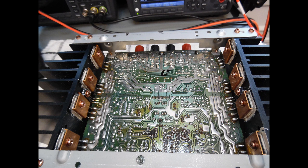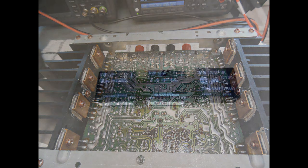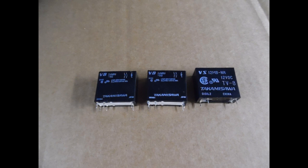Also replace the speaker selection relays — when you look at them they're heavily oxidized from switching. On the power input board there is a 16-amp switching relay that was replaced, along with the two speaker protection relays, which are 24-volt double-pole changeover relays. These relays become oxidized and can cause intermittent sound loss and low-level distortion, so replacing them eliminates that issue completely.